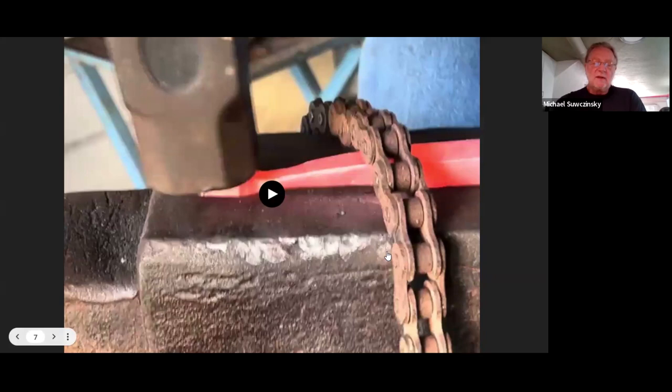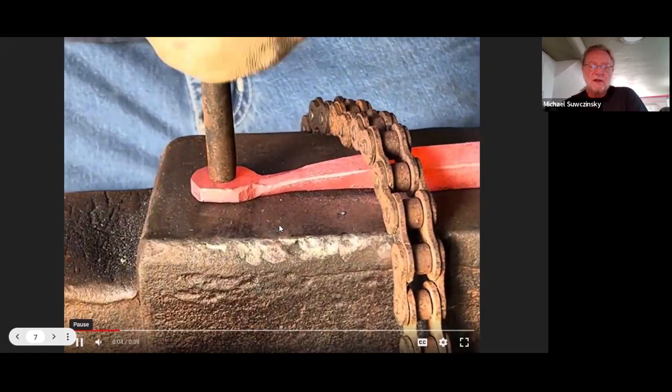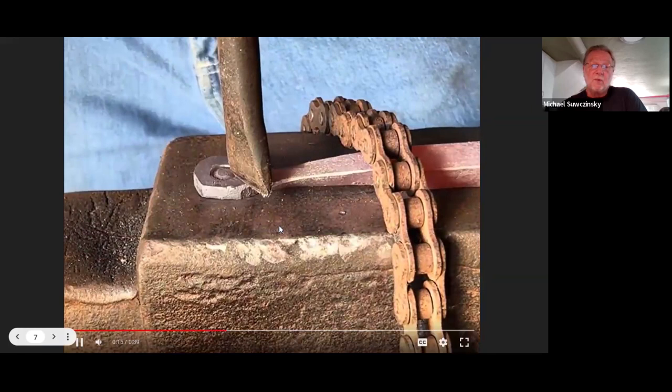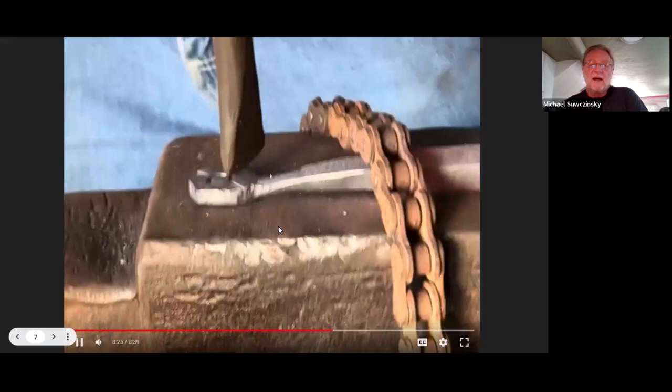The next step is we start doing some shapes. I use a motorcycle chain over my anvil and use the hollow ball punch to create the initial shape. It's always best to rotate the tool in case there are any inconsistencies in the ends of it. Then we go with a chisel — I like to divide into broad strokes of four, and then separate those strokes again to make a relatively even eight spaces, though some of my earlier flowers only did five or six.